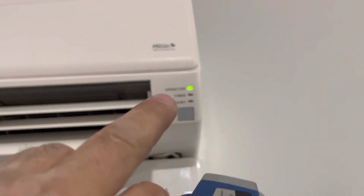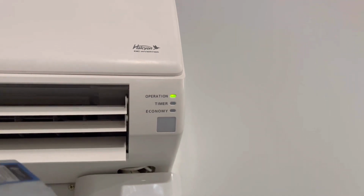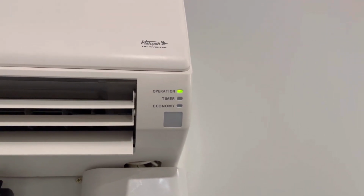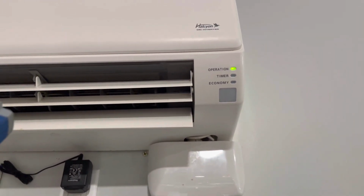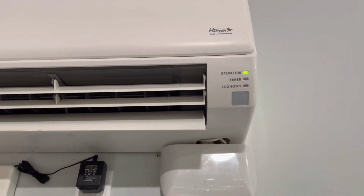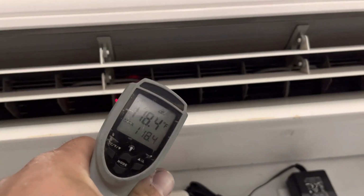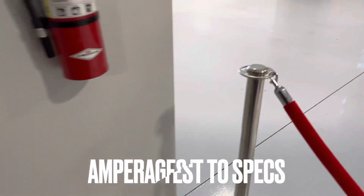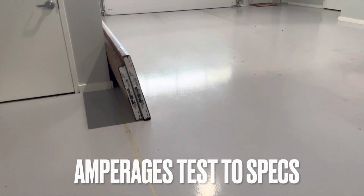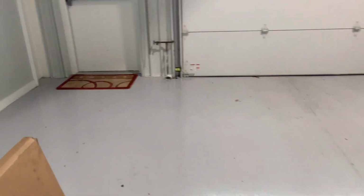And we check what we do. We check the ohms of resistance, and they were all equal because it's an inverter setup. They're not supposed to be equal unless it's set up with a DC inverter, I believe. Most applications anyway, but I know on these, that's how they're supposed to be. Go check amp draw to make sure that it's within the rated amps, because, well, it wasn't burned, but it was just a weak connection, I think.